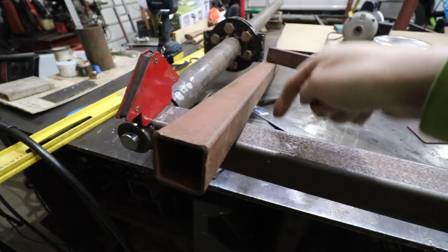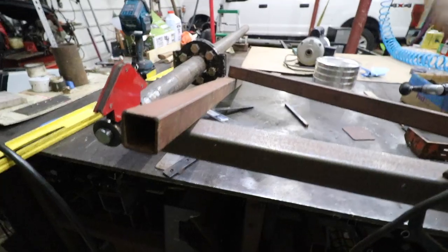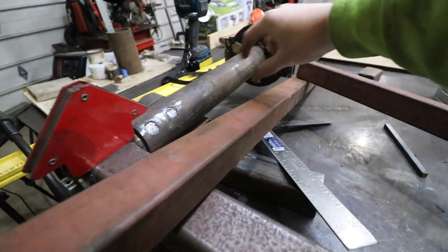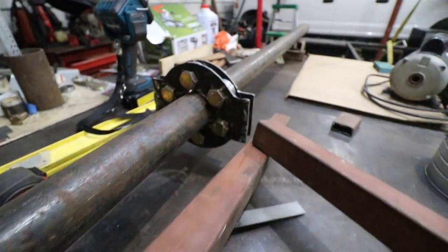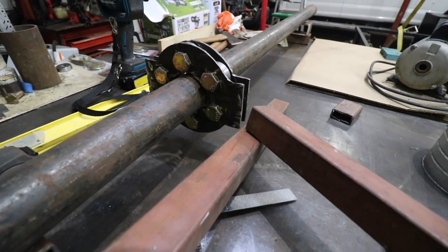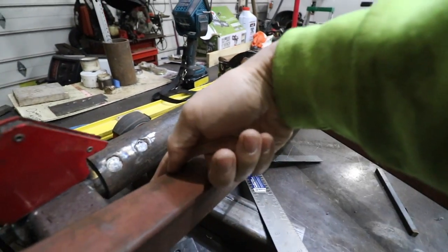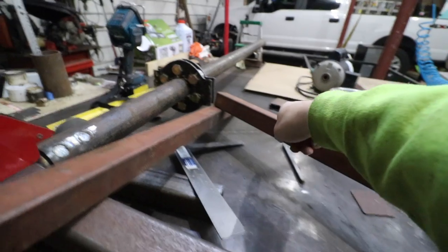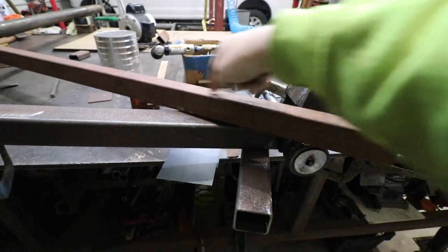What's going to happen — this is going to be welded onto this piece of 2-inch. This is like inch and a half or so, a little bit smaller than 2-inch, but I have it so I might as well use it. I'm going to weld this on the bottom here, parallel to the mast. It's going to get welded onto either side of my bearing roller device, which I spent a lot of time building and which came out pretty darn perfect. So weld here, weld here, and I'm going to have to cut this — figure out whatever angle that is. This brace is going to go up to right before the knuckle, and that's going to be a tricky cut — I'll probably have to do both cuts with an angle grinder.